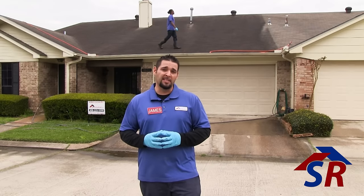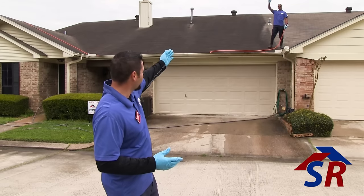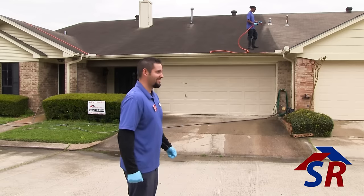We're using industrial bleach — it's the only product endorsed by the roof manufacturers because it doesn't require a high-pressure rinse in order to get the roof clean. As I follow Jaren, my specialist, we're going to get this roof clean using a method that is very efficient as well as safe. We work in strips or rows of six to ten feet wide, bottom to top. The reason we do this is so that you get a nice streak-free finish, and so that as we move along, if any touch-ups are becoming obvious, we can easily treat them without having to step immediately on slippery shingles.